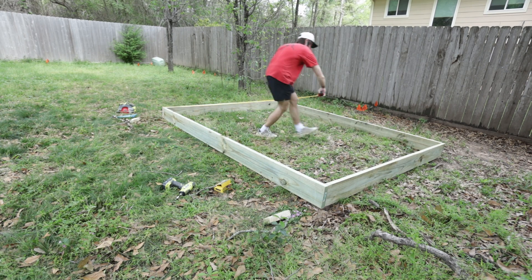Next up, we go to our walls. Three of the walls are eight feet tall, and the front wall is 10 feet tall, which gives us our roof slope — this is a lean-to roof and it's really simple to do. I use two-by-sixes and I use the same size for both the ceiling joists and the rafters. Now I'm going to go to the wall sheathing. This stuff gets heavy, and it continues to get heavier — making sure everything's nailed in nice and tight.